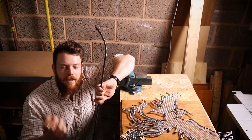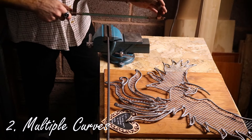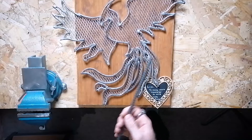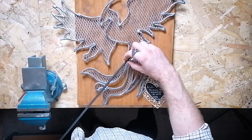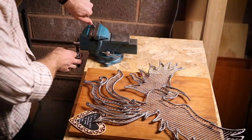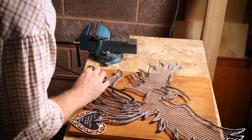I'm going to show you in real time how I would do this for a sculpture like this phoenix here. I'm going to choose something relatively challenging so you can see how this can be applied. Taking this piece, starting from one end you can see there's a slight curve to start off with, then it comes into this big sweeping curve, and then back to another curve - there are actually three curves going on. I'll hold my metal up and look at where that curve starts. When we're bending, if we put the jaws on the point of curving it's actually going to curve after it because of the thickness of the metal, so we need to start just a little bit before.